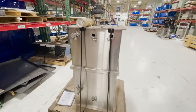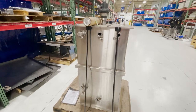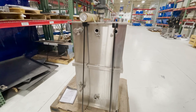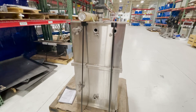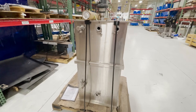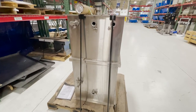Why do you need a pre-coat tank? You want a tank to set up the pre-coat for your filter press. You fill it with ethanol or water and add your filter aid. Our typical starting point for filter aid is 0.1 pounds per square foot of filtration area. So if you have a 100 square foot filter press, you would use 10 pounds of filter aid. That gives you about a 2 millimeter coating of filter aid on your filter cloth. The process is to close the lower discharge valves and circulate at 0.25 to 0.3 GPM per square foot to get proper flow.